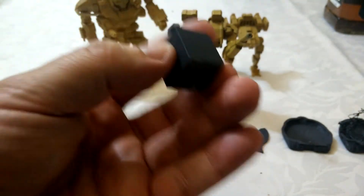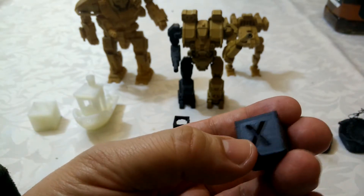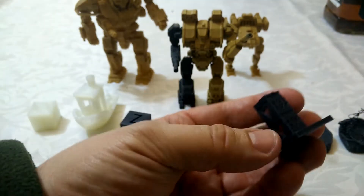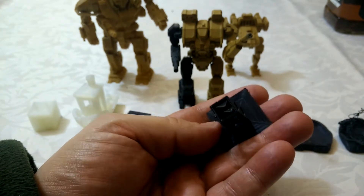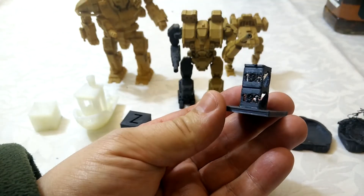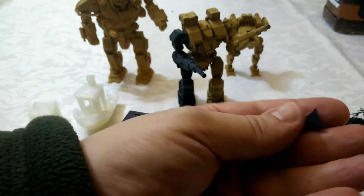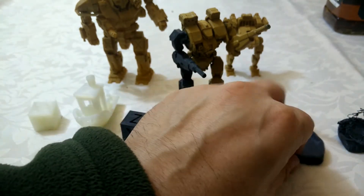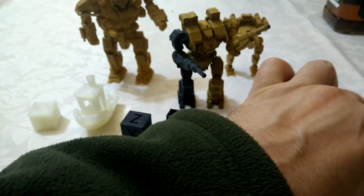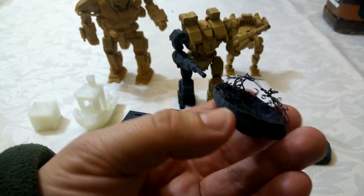We then swapped to my new filament — not bad, a little bit of funkiness in the corner, some ghosting on the letters, and maybe a little under extrusion because of gaps at the top. I then tried to print a temperature tower at 0.4 resolution — definite signs of under extrusion, the tower is fairly sturdy but missing some detail in the letters and numbers. Then the coin with under extrusion, the fish which didn't quite work, and the first cat which I cancelled. I then tried again but didn't apply the bed adhesion 3D lac properly, so it came loose — spaghetti hell.